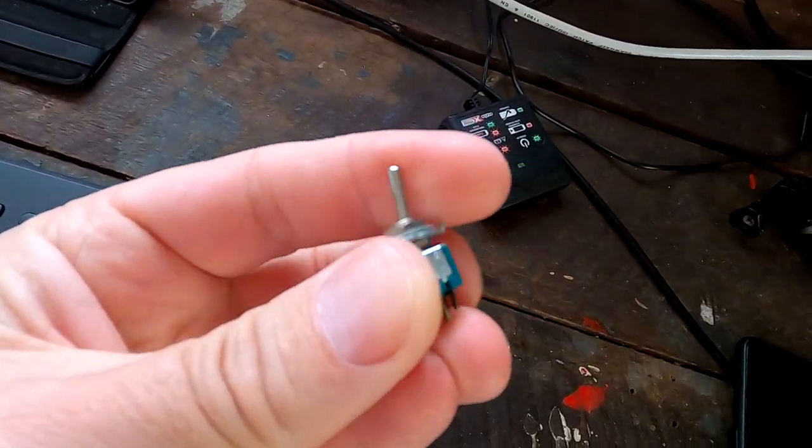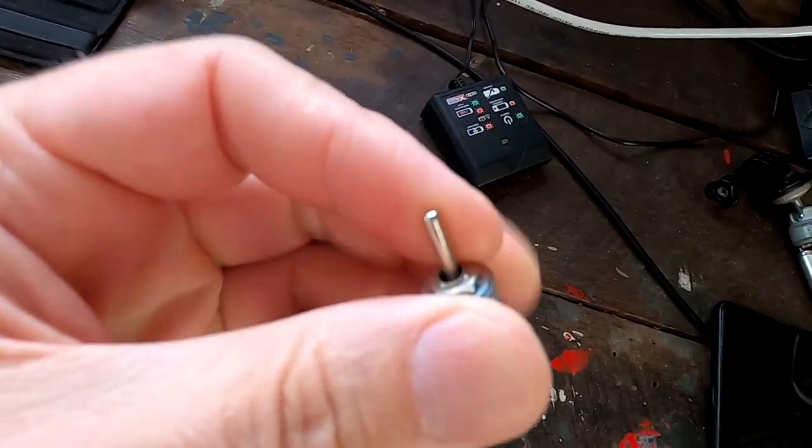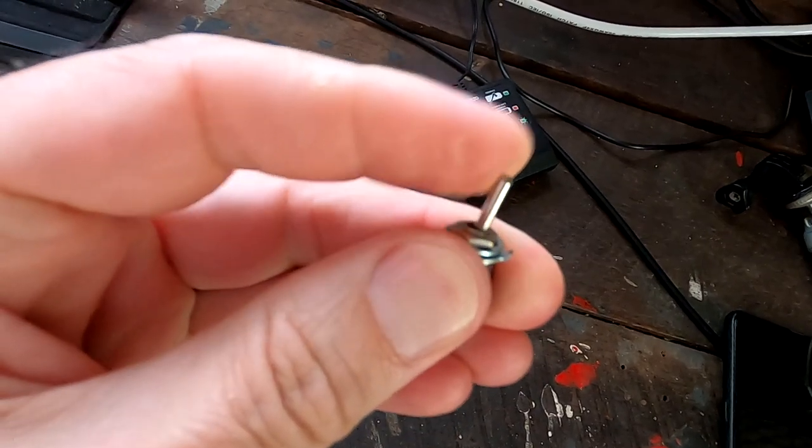I also want to add this little switch here to the BMS, so we can turn the balancer on and off manually. Because as we know from a lot of previous testing with these active balancers, you should not leave them connected all the time. They actually unbalance your pack if it's not fully charged. So only turn on these balancers like you would do with the other balancers of your BMS as well. And yes, they can run in parallel with the balancer on your BMS.